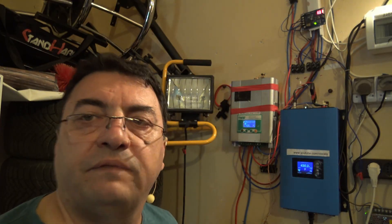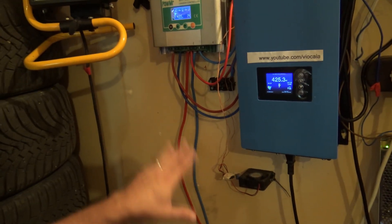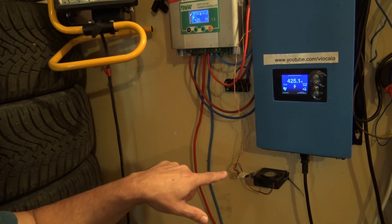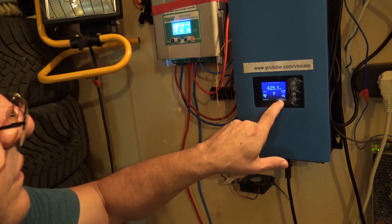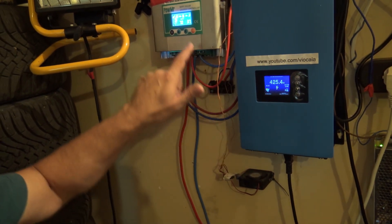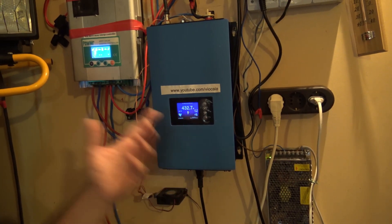The concept of having batteries between the panels, the MPPT charger, and the inverter is absolutely great — it smooths everything out. You can use any batteries; it doesn't matter if they're not powerful or are half-worn. The point is just to have enough energy to smooth out a minute of no sunshine. One final element: this little fan here is moving air in this area. Without it, temperatures would be several degrees higher. With it, the inverter is at 43°C and the MPPT at 37°C — which is great, especially since power consumption is low today.